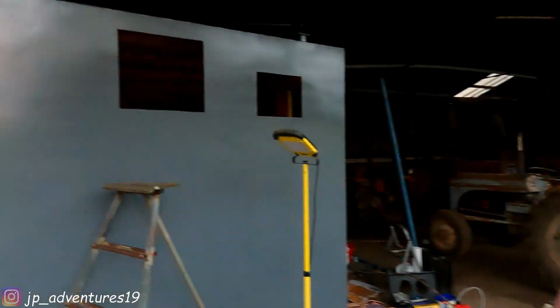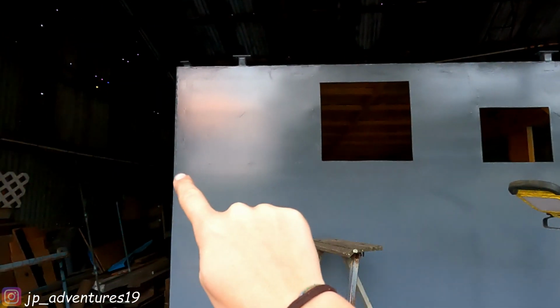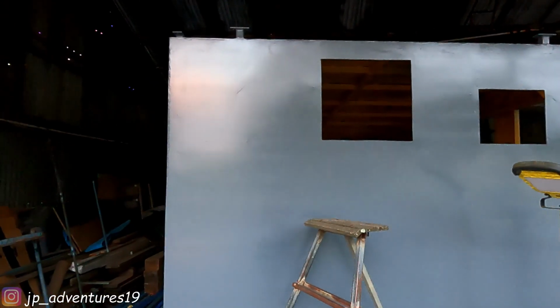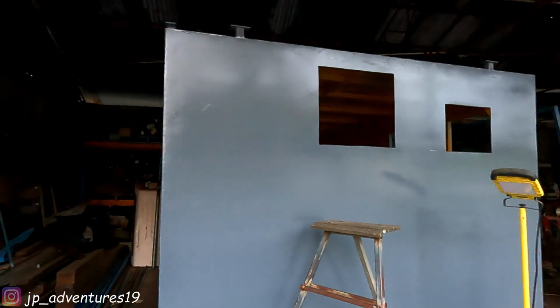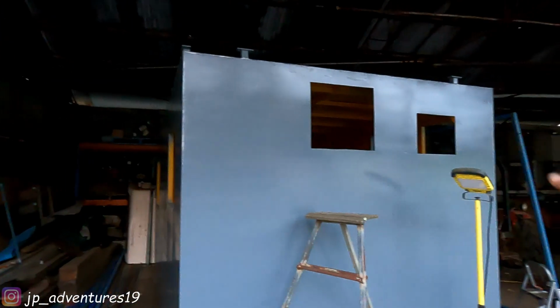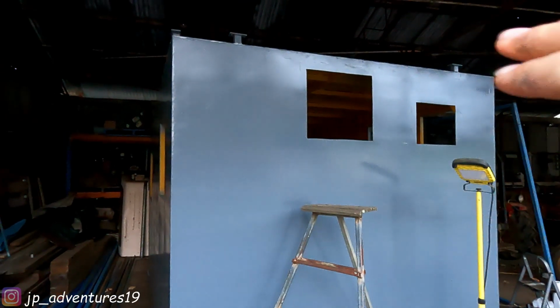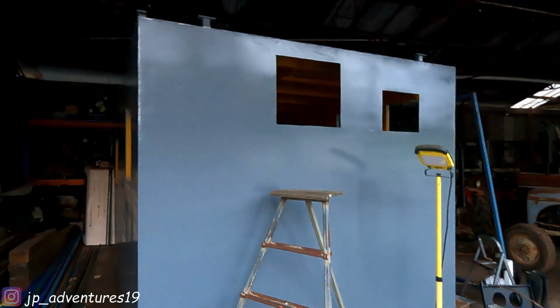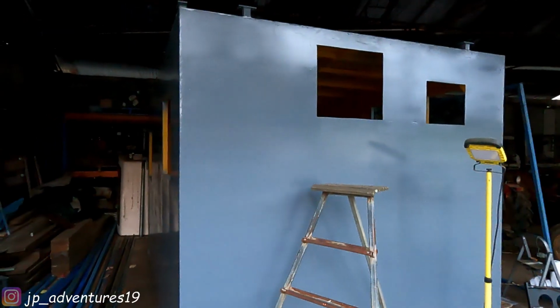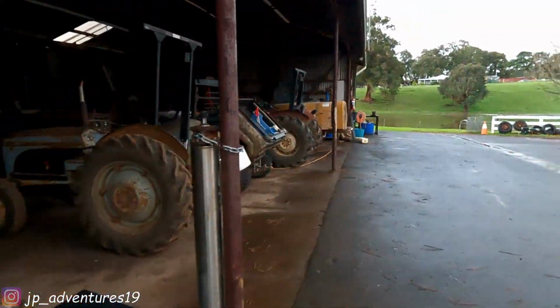If you are wondering why we drill holes into the bars, this is a quick explanation of the whole overhang. So the overhang will be around here, down here, and only until here. And it will be removable because we still have to be able to tilt the cap. And so we drill in a bunch of holes, two on each side and a bunch on the bottom and top, so we can actually remove it again if we have to, and we will drill through a seal as well in the middle, so it should be waterproof. And yeah, that's what we're doing right now, and then we'll weld everything together and see if it works out.